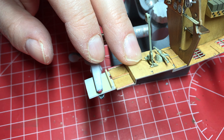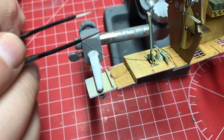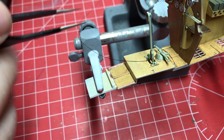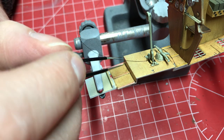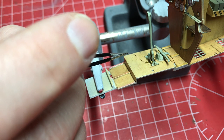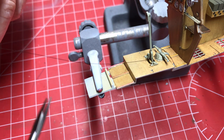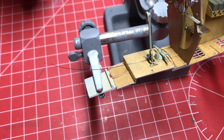A little blow on it just speeds up the activation time. So let's just see if we're attached. Yes, we are. And then it's coming through a little pulley here. You can see side on the fastener point. There's a little pulley. Obviously, I'll show it to you properly when we're done. That needs to then be in the groove of the pulley pointing upwards to go through that bulkhead, so we need to glue that like that. That's grabbed now. So that's going to pass through a bulkhead here, and then we're going to terminate it in the floor. So I'm just going to cut that one there.